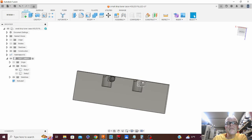So we've got this wonky hole in there. That is for this part here. Don't know if you can see that. But we don't have all of that machined yet. We don't need to hold on to that tapered part. So I'm going to go in there and draw some stuff on that jaw and cut it out a little more so we're not even touching that part.